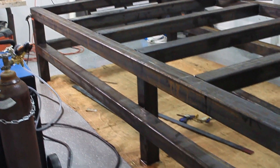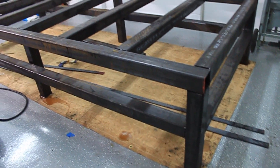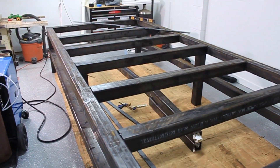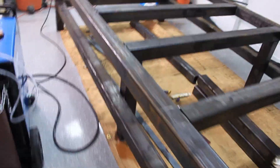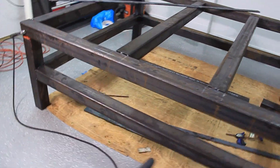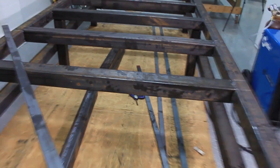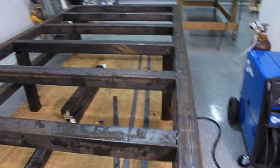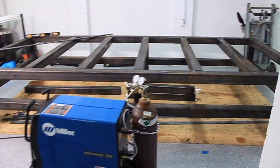There's another video where we've got it all tacked together. This is still prior to welding — right now everything's pretty much in a solid state, level and square. The flat rails you see on the floor, those we're actually going to end up using to tap the holes into, to screw our other 25 millimeter rails to in a later stage. This is just regular 4x4 quarter inch steel as I discussed in the SketchUp videos.